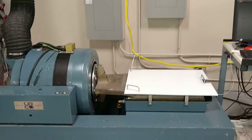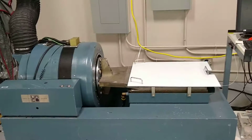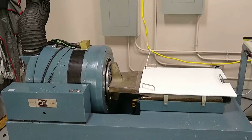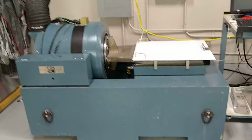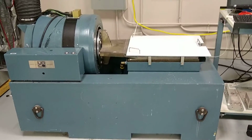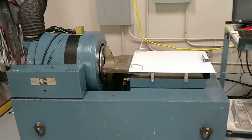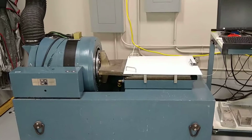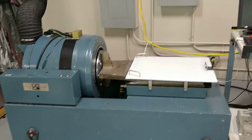When you launch a satellite or anything into space, well, you deal with vibrations from a rocket, right? Because the rocket is not going smoothly up into the sky. It's a very, very rough ride. And you can deal with accelerations that are 25 times stronger than the acceleration on Earth. So 25G or even 26G. So the problem here is that with these vibrations, you can actually tear the satellite apart.